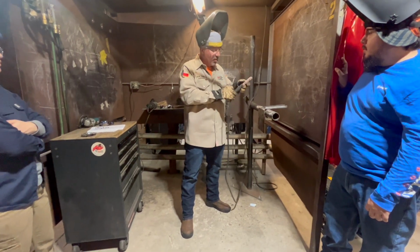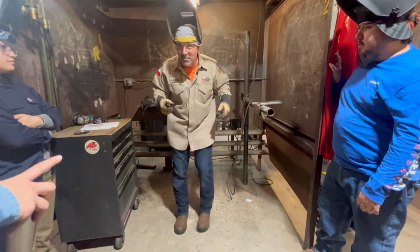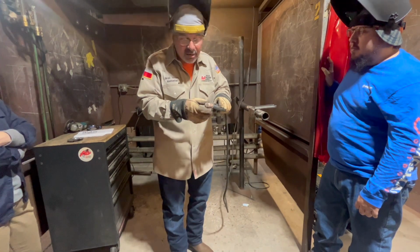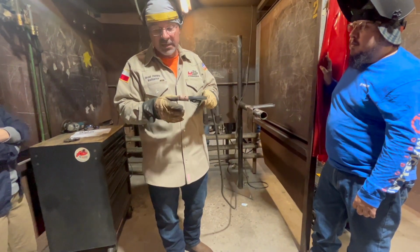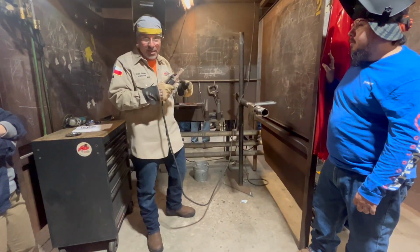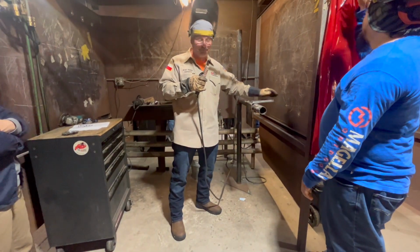They ain't teach us that. Ain't nobody showed us that. Well, what'll happen? Keep an eye on your stinger and it'll start getting loose. If it does, tell me and we'll tighten it up so it won't fall off. Then when it falls off, everything you touch with your stinger will arc out. You'll be burning it up. If everything falls into place, you'll shock yourself real good.